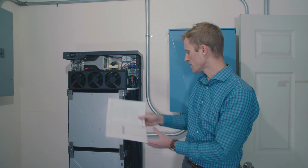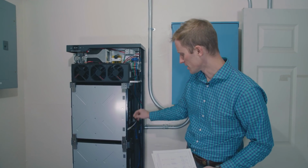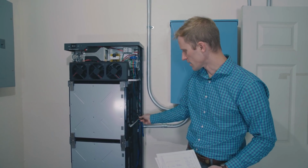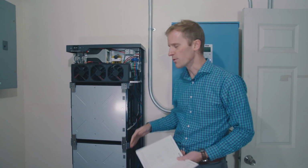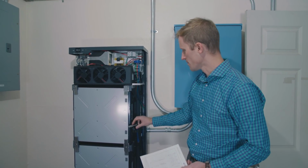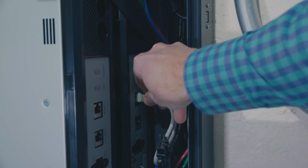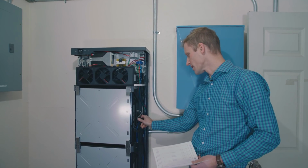So what you're working with is this black power cable, which connects very simply to just these ports on each of the batteries, and they're angled at exactly where you want them to be. But the Cat5 cables can get a little confusing if you haven't done it before, so here's what you want to do. This gray cable is connected to your B-Link, the power electronics device in the top of the enclosure, and the first connection you're going to make is to take the B-Link and connect it to the in COM port on the back battery module here.